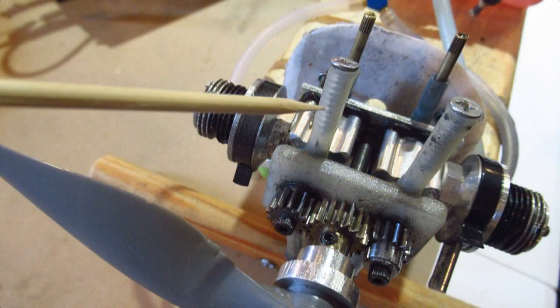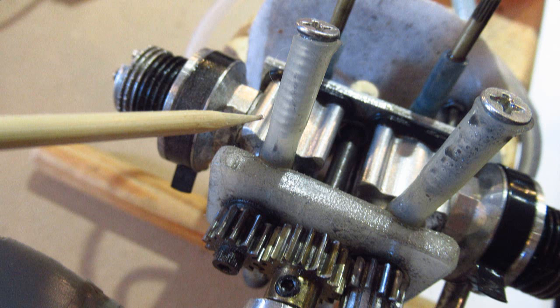Let's figure this out. What I've found is that the oil reservoir hoses need to be cut and separated from each engine, as the front bushings of the engines were leaking a little air from so many years of running. That means the needle valves were actually controlling the other engine and vice versa. Separating the crank cases from each other cured the problem — I was able to set the engines individually, as you'll see here.